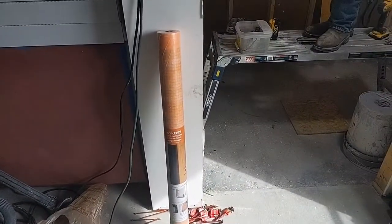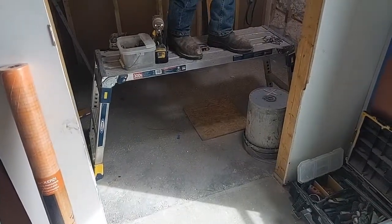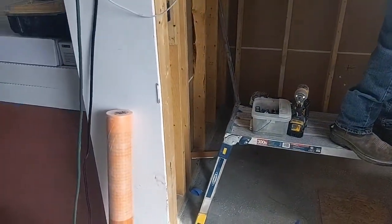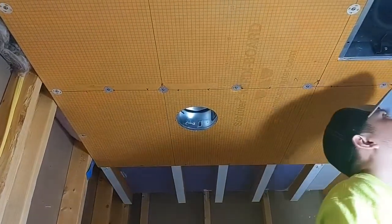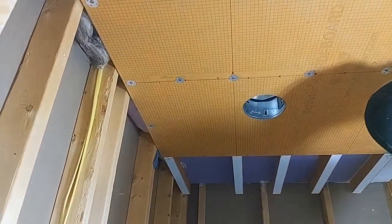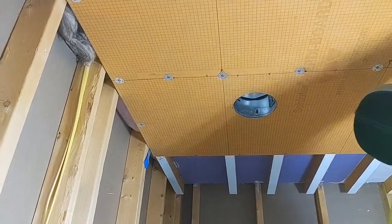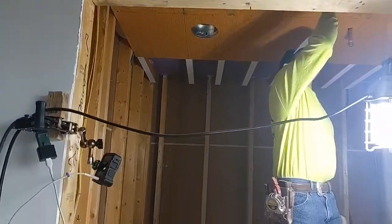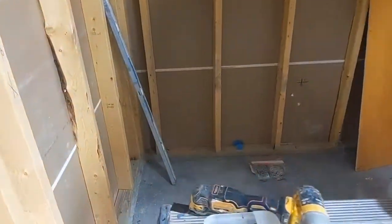Any of the seams, they'll do it over the pan that we poured, and they also make smaller strips that he'll run over all of his joints where he screws it in. As you can see, the screws all have their own little washer so that way it doesn't pull through that KERDI board.